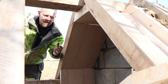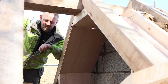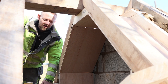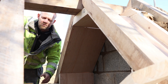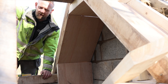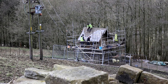We want to get all these internals fitted out before we start on the roof, as it makes passing materials in a lot easier. We've also got some bat roosts going in on this top floor against the wall. We're going to core some holes through the masonry and probably make some lead bat access points from the external, though we haven't fully figured that one out yet.